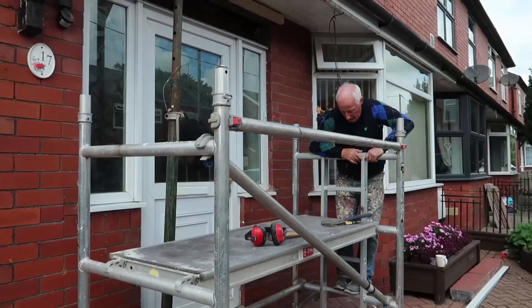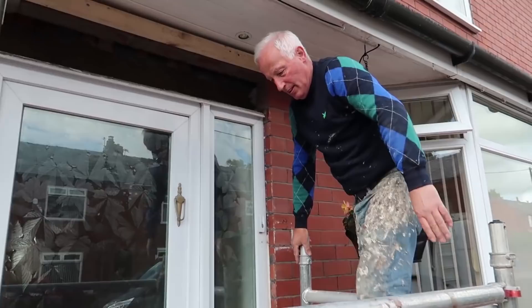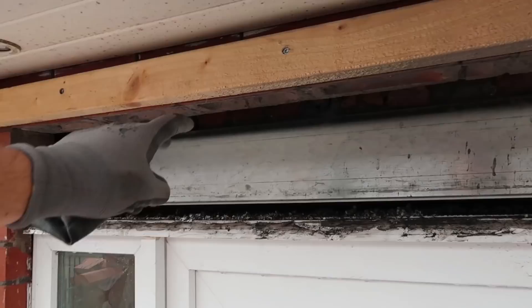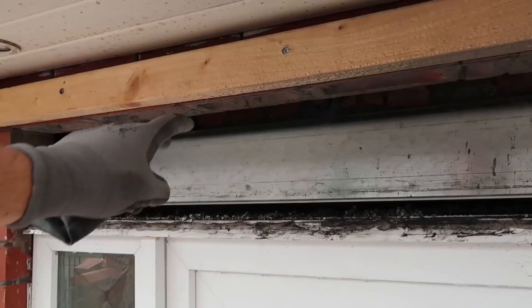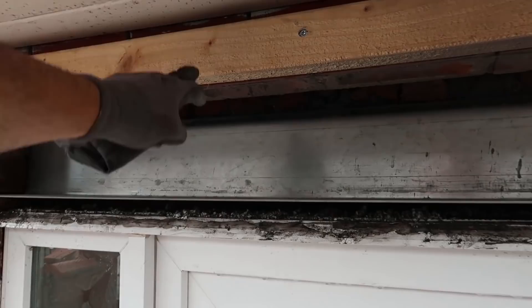Got a little scaffolding set up with our mini guard rail — safety first. We've managed to get the lintel in, but what we've had to do is cut a fair bit of this joint out so you can get the lintel in that way and then put it this way. We temporarily took this acro prop down just to get the lintel in, but I think we'll just put it up again as a precaution. We've drilled this in here and drilled the bricks.